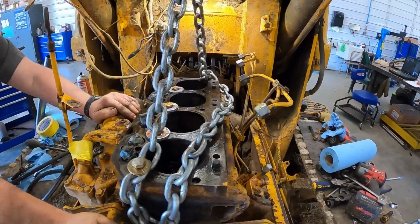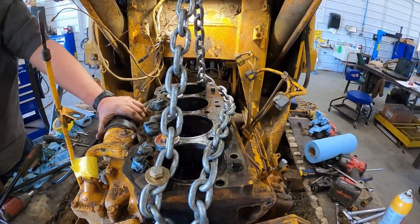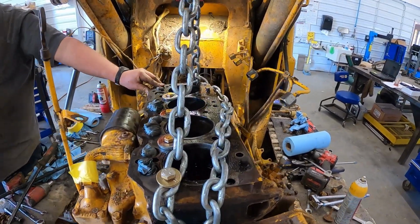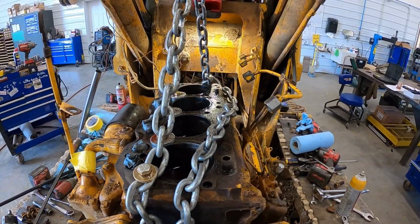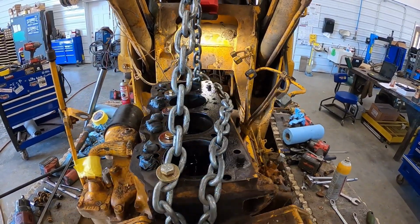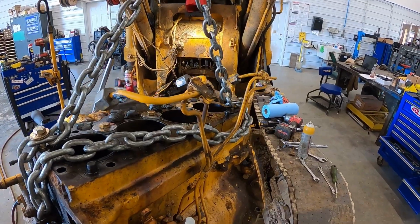All right, you guys see we got the hard nose off of it and the radiator. Actually got the engine getting ready to pull it out right now. So there's actually only 4 bolts that hold it to the transmission there. So it's really pretty simple. A little bit tight getting in there, but not too big a deal. So we're getting her wiggled out of there right now.